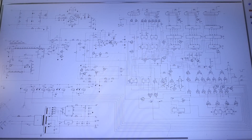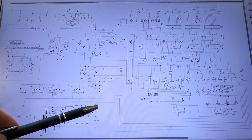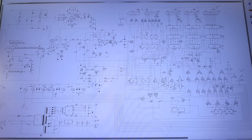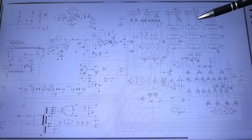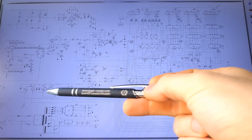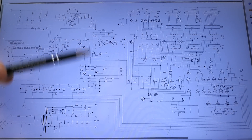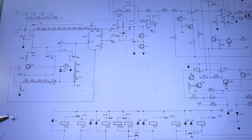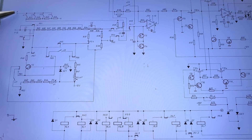Now of course the properly complex schematic. The mains goes in here, there's the exploding filter, the transformer. Here it generates plus/minus 15 volts — or actually plus/minus 12 in this case — five volts and 200 volts for the Nixies. These three Nixies have the decoders, latches and counters, and these two are driven by transistors. The decimal point is also driven by transistors. Here is a lot of logic, probably in the auto-ranging system, controlling the relay coils. Some op-amps, transistors, and here is the input section.